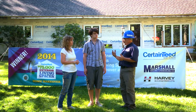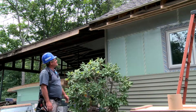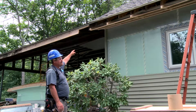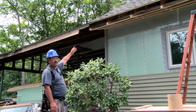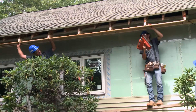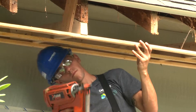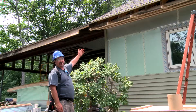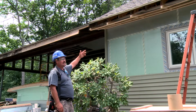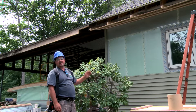As we get to the top of the wall, we're dealing with the overhangs — that's when we have to talk about ventilation and completing that venting system. We put a nailer across the house at the same point as the back part of the carport. We took two-by-fours, cut angles on them at the same angle as the carport, and nailed them up, then strapped it from there. This way, when we put the soffit up, we'll have a nice, smooth transition on the same plane rather than a wavy look.